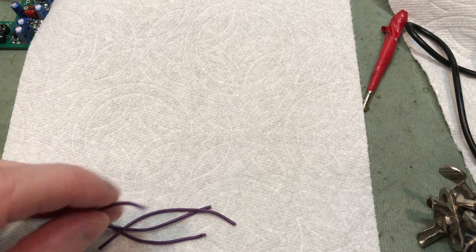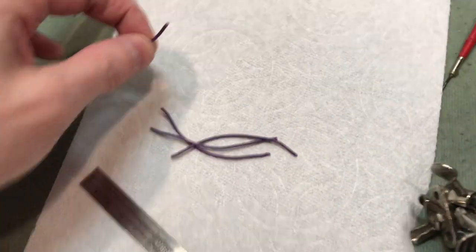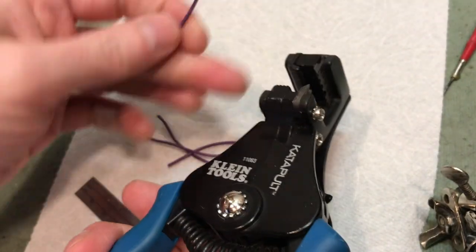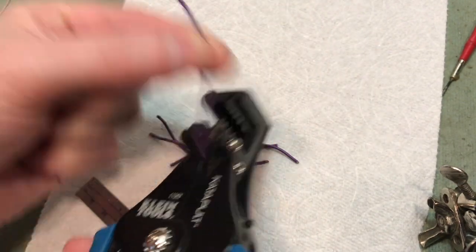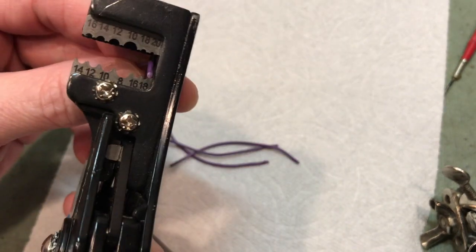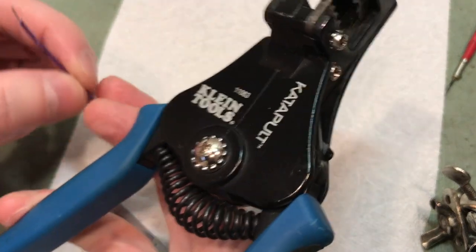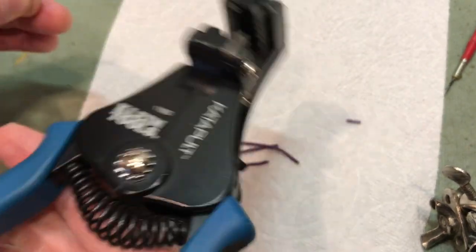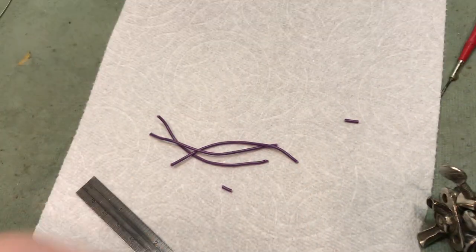Okay, now it's time to make the jumpers. We're going to go to the jacks in various places. So what it says is cut 4 2.5 pieces of wire. This is, I've said before, one of my favorite tools of all time, the Klein stripper. Makes stripping wire quick and easy. Don't forget to tin the tips.